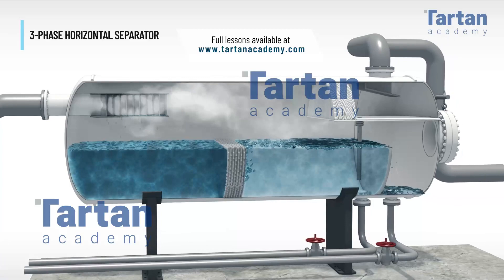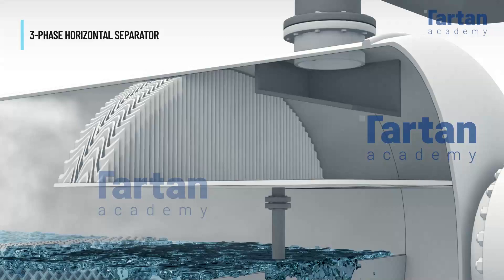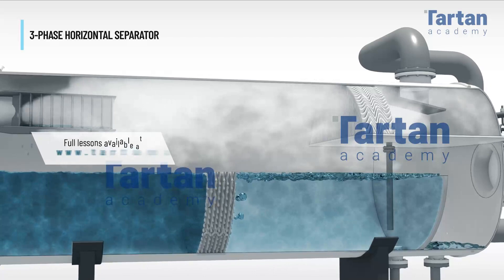while a mixture of vapor, mist, and gas flows through the top. The gas phase passes through a foam breaker and then a demister pad or corrugated plate before it goes into the processing plant or the next compressor.